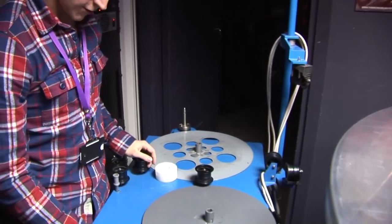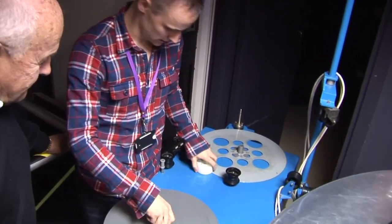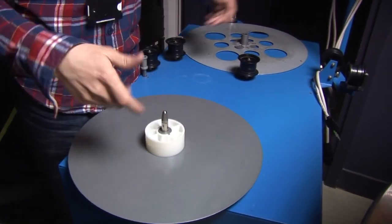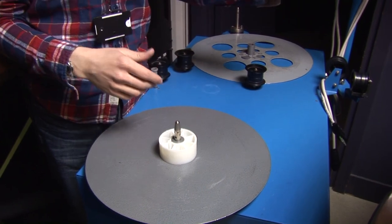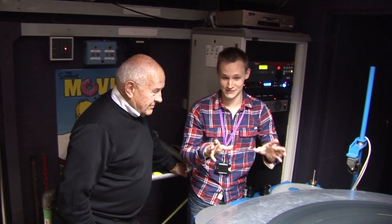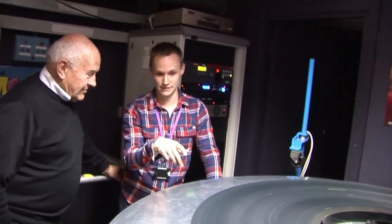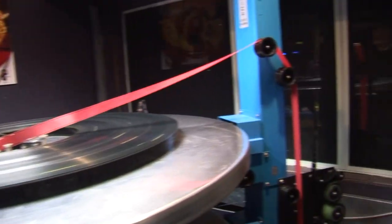So, you've got a motorised spindle there and a free wheeling one on there. If I was breaking it down, you'd be putting your bobbin on here. The film attached to this comes all the way over here, you whiz it all off, you have to disengage the motor off of this. This free falls basically. And you've got an electric motor to do it now, don't you? This is the electric motor on here, but this free spins and you have to have a cloth in your hand and brake this as you're slowing it down. So your coordination has to be bang on, and I cannot tell you how many films have been ruined from trainee projectionists doing this. It takes quite a while to get right, I think. Some people find a problem, some people take a bit longer. This whole thing will wobble. This goes at an incredible pace when it's really running. This will do this when it's breaking down.